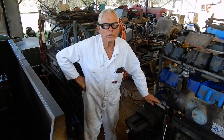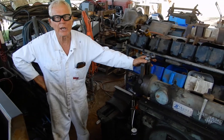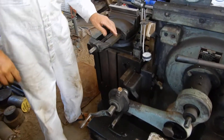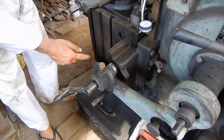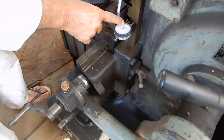Hi, this is Neil here from the dirt floor workshop. Today's video is about the shaper, and more specifically the table feed. The table feed is controlled by this screw which runs through here. The table feed has got a pitch of 200 thou, and I'll demonstrate that.